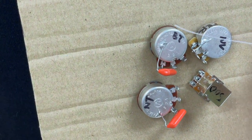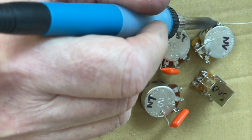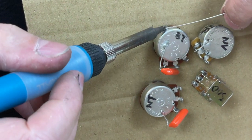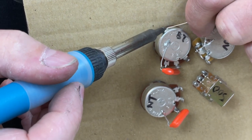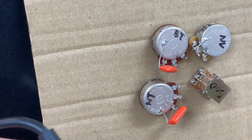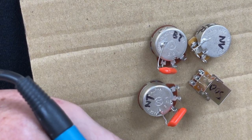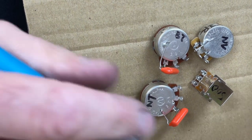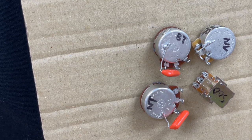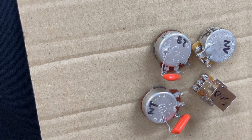And this is me working as completely double chinned as I can do. So I'm going to ladle some solder onto each of these so I can follow around with my wire. I'm working left-handed now, which isn't good. And I haven't loaded this wire at all with any solder, which is another silly thing. If I want it to work, let's begin with a bit of loading.